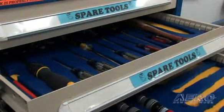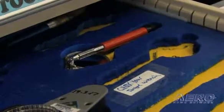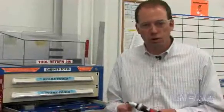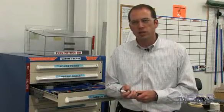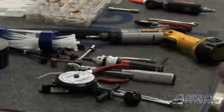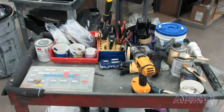Tools can be left inside the airplane, so programs must be put in place to make sure that that doesn't happen. Our tool control program is comprised of a lot of boxes. Almost every station throughout the plant has a tool box. Inside the tool box is cut-out and organized foam. The tools are uniquely identified. Those which require calibration, such as torque wrenches, have a calibration date and expiration information on them. They're checked every day by the technicians at torque calibration stations to make sure they're still within acceptable limits. This is really a big thing for us in maintaining a high-quality airplane — making sure that when a nut's turned and torqued it's done to the appropriate value, and secondly, making sure that we don't leave tools around the place. It's checked before every shift and at the end of every shift, and there's a log that the supervisors have to fill out to show compliance with the tool control program.